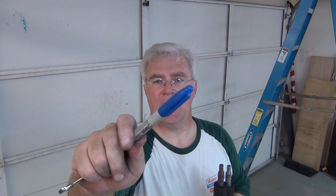But I've done it in the past with just steel pipe I've gotten from the Home Depot, as long as that fits nicely into those sockets and those keepers. Have a marker with you when you go up and mark which side you consider 0 so that every time it comes around you can count 1. My door is 7 foot, I want to count 7 full rotations.